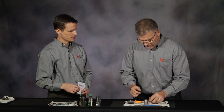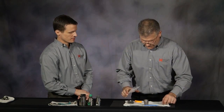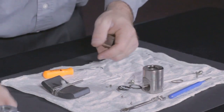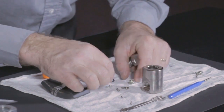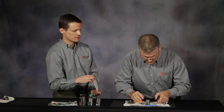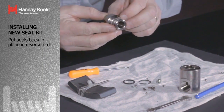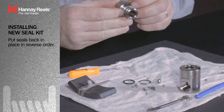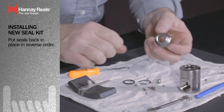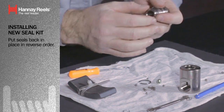And at this point we're going to put the new seal kit in. The supplier was nice enough to include instructions in here on how to do this operation. Basically what I'm going to do is work the furthest one in first — reversing the order. This is the dust seal; we're going to put it all the way in place. And if you notice in the packet, there is a small washer — that's actually for swivel joints that do not have grease zerks in them.